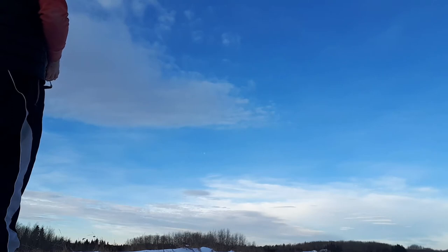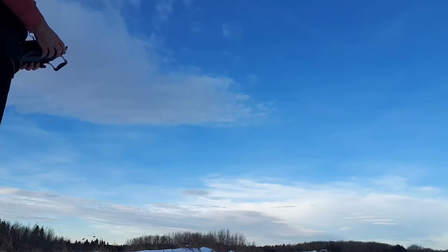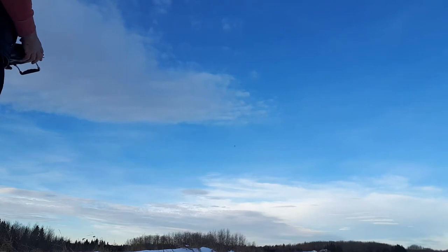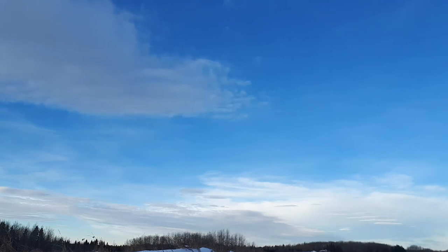That right there is 50% throttle. I haven't had to touch the reflex at all yet. Holy crap, that's actually working! I do have differential drag in there, but there does still seem to be some adverse yaw. It is flying — adding some reflex, yeah, that pulls it up alright.